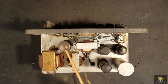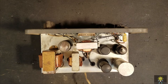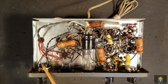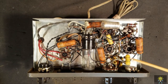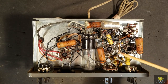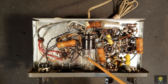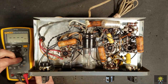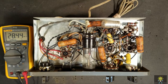We have the diode, which I believe is a full wave rectification. On the underside we have a bunch of old wax caps that have to be replaced. We have an electrolytic here that needs to be replaced. We need to check out each one of the resistors and hope that the eye tube is still in good shape. So we need to make some basic measurements — check the power cord, see if it's operational.